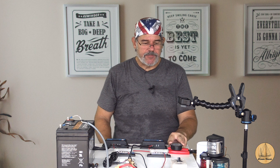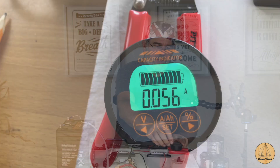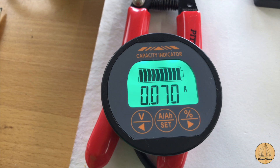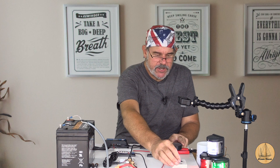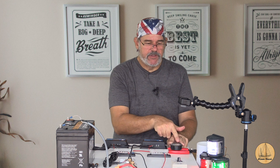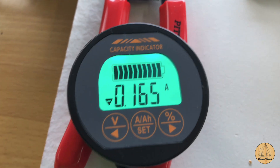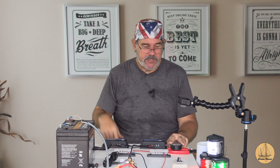I'm going to turn on my navigation lights. We have 0.5 amps coming in — as I turn these on, the amperage starts going down. I have them on dim and we can see the number dropping. We now see a negative reading — I am drawing 0.1 amps out of my battery bank more than is coming in. At any point in time I can see whether I am net positive or net negative. I'm going to leave this running; I want to see the batteries discharged and check how well the monitor shows actual usage.